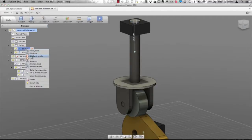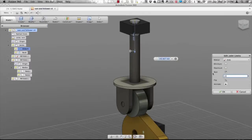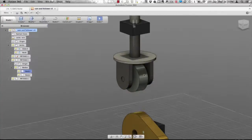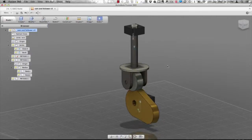Let's go over to that slider joint and edit the joint limits. We'll put in a rest position of 140. What this is always going to try to do is, as I drag this up, it's always pushing it back to a resting position of 140. This is a great way to simulate gravity, springs, or a number of things you may want to simulate in your design.